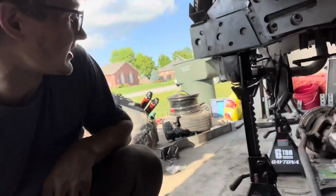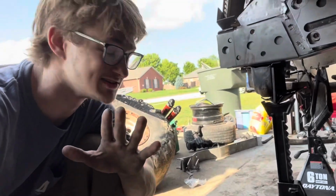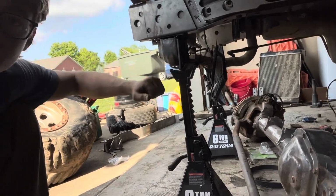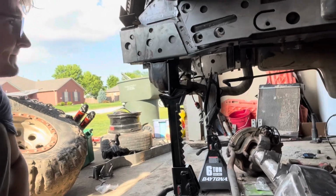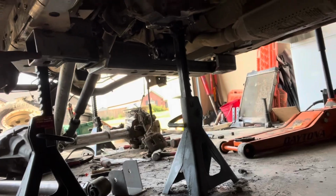All right, it's about 5:30 today. So today we had a little bit of a mixed batch. My buddy came over and we moved. It's not as sketchy as it looks, but we have our jack stands attached to the old radiator support now. And so this sits at about ride height now. We have the cross member fully tacked in. This is tacked in still. We have the other side frame stiffener tacked in.